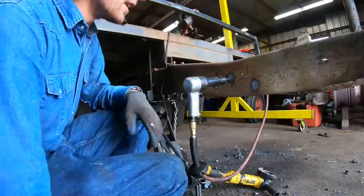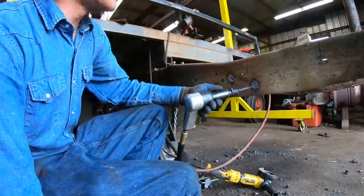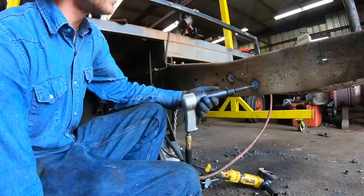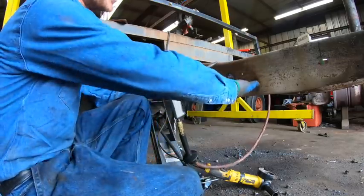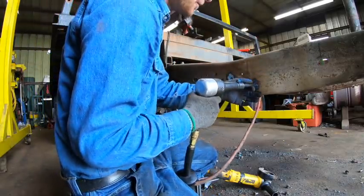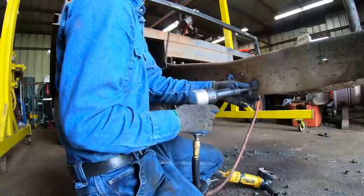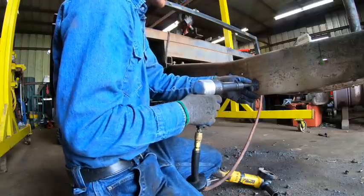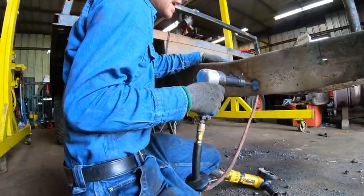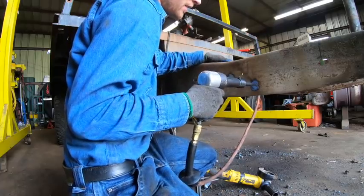Another lesson that I'm learning the hard way. You would think if a tiny bit of the divot that you're punching into this is on the frame, it'll just push up into the rivet, it will not. You have to make sure this is on the rivet. And if you get a false start like I did, as you guys just saw, I wasn't really planning to demonstrate that, but I ended up doing it nonetheless. We gotta work with this in the center here.